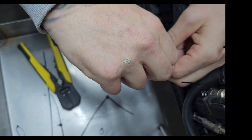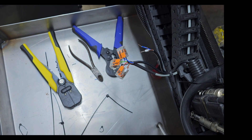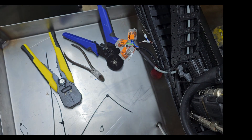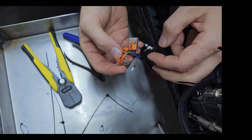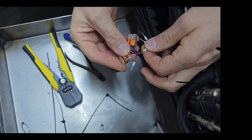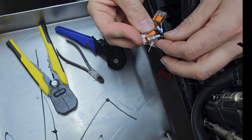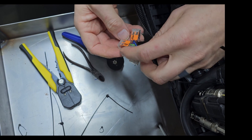Repeat that for the other ones. I like to twist these cables just before they go in because they can fray a little bit. Anyway, they're all done. All I've got to do — and I'll show you how these wagos work — the brown one just goes in the wago all the way to the end. You can actually see through these. Flip it in and it's done.